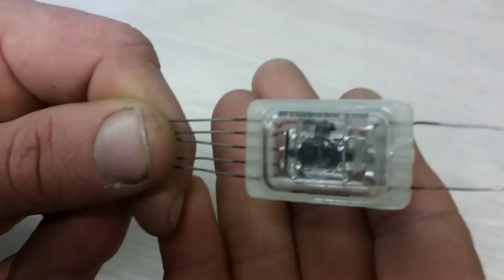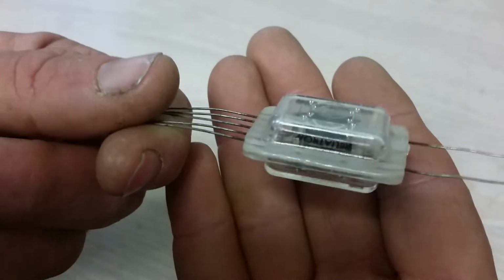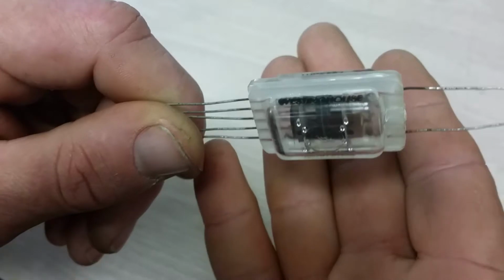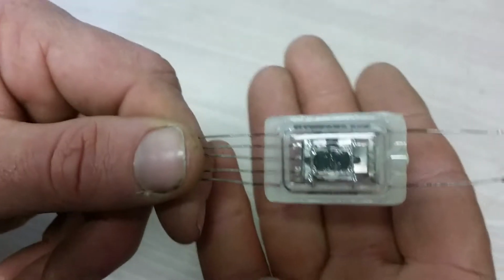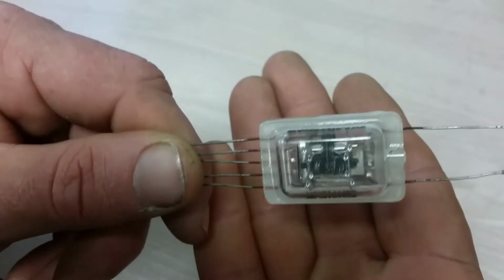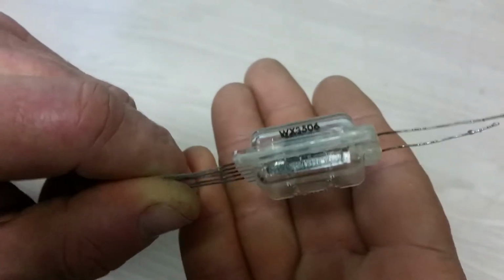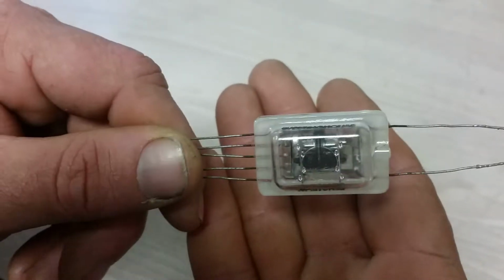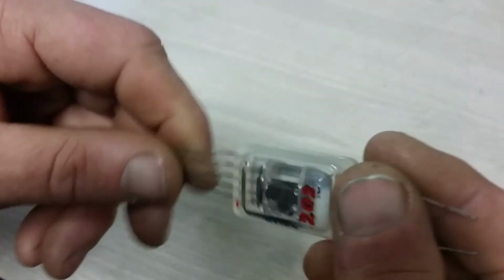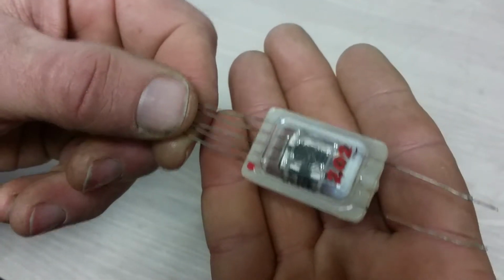And maybe that didn't work too well. Frit seals are used on CRTs and such, but generally are not used when electrodes are concerned. So that may have been the fatal flaw of these, and why they seem to all be going gassy or have gone gassy. And it's not just me. Some of the other collectors that have these tubes, theirs have gone gassy as well. So, interesting idea, but I don't think it was going to work.